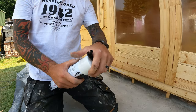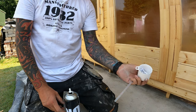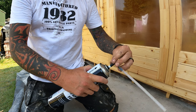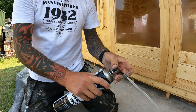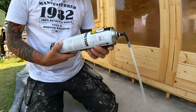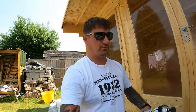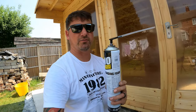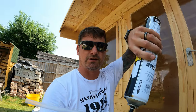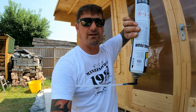There's your little straw that you're going to need - pop the lid off. It does come supplied with some gloves. Swizzle that on the end there, and you'll know it's on because you won't be able to tighten it up any further than that. You've got to shake this up - just like that. When applying your expanding foam, you don't hold your tin this way - it goes upside down so the foam can come out of the tin.